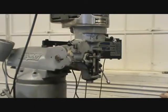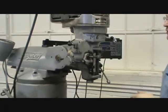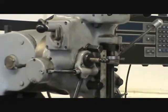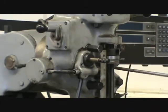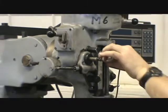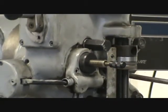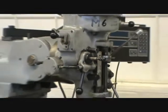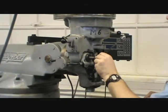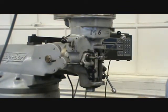Turning on the spindle — you can see it's rotating clockwise. If I engage the power feed lever, the quill goes down and disengages when it hits the depth stop. To reverse the feed, pull out that knob and engage the feed — now it feeds in the other direction and stops when it gets to the top. In between positions gives you neutral.